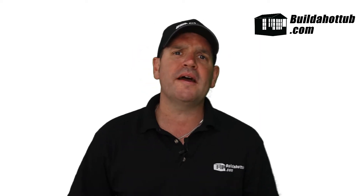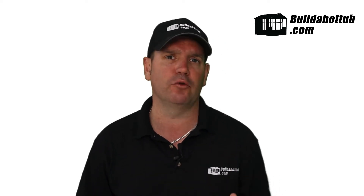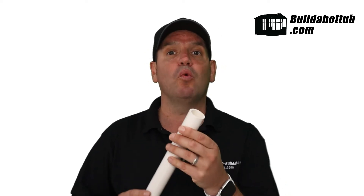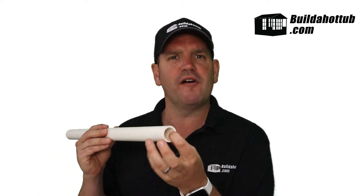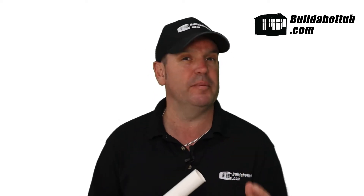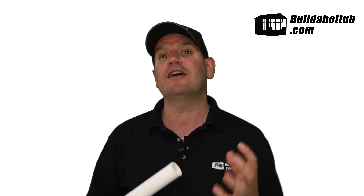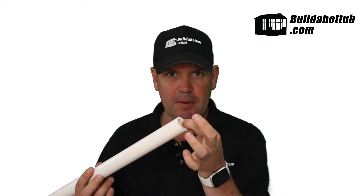In terms of ratings, they are often expressed as classes — Class C or Class D are totally fine for your hot tub builds. What about Schedule 40 or Schedule 80? Schedule 80 you don't need — it's way too high a rating and very expensive. Schedule 40 refers to the actual wall thickness of the pipe. Here's a piece of one inch Schedule 40 — the wall thickness is around four to five millimeters. The exterior diameter doesn't change; it's still one inch side to side, just thicker on the wall.